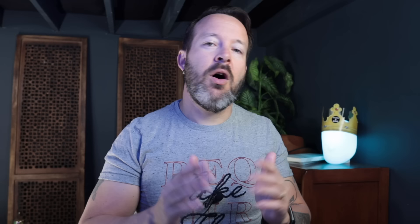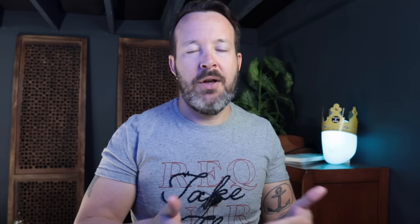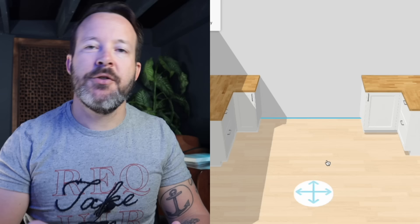A little heads up: when you're looking at these in the kitchen planner it says they are 47 by 26 by 30. All other cabinets in IKEA are 24 inches deep. Attached to the blind base corner is a 2-inch filler strip — they already attach it for you, or rather you attach it when you assemble it, but it's already part of the package — and it makes the overall depth 26 inches. So that's the first two ways, the easiest ways, to design base corners using IKEA.